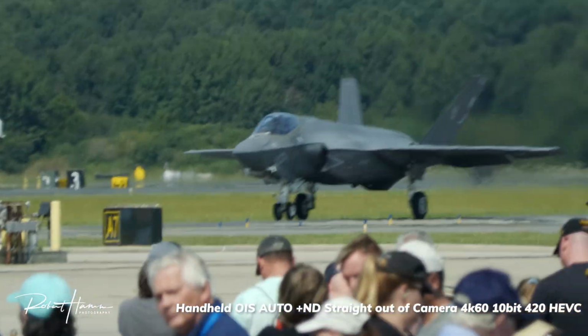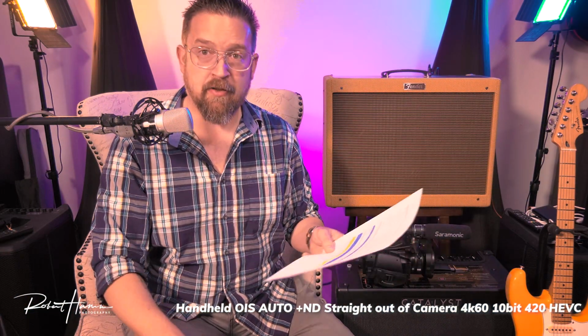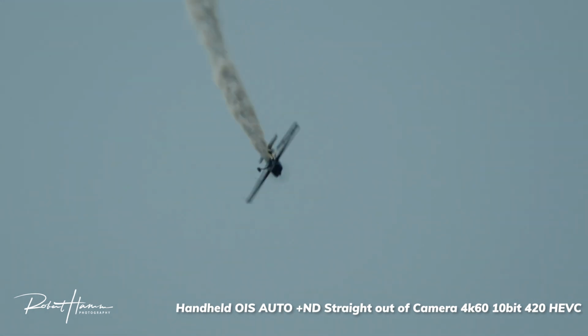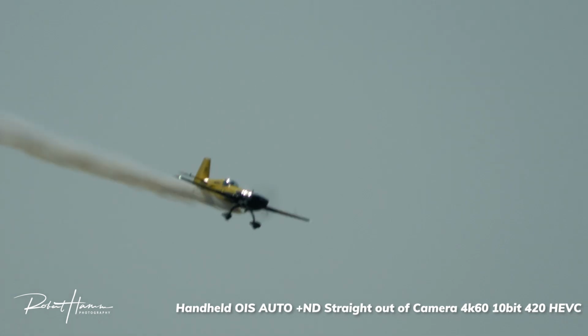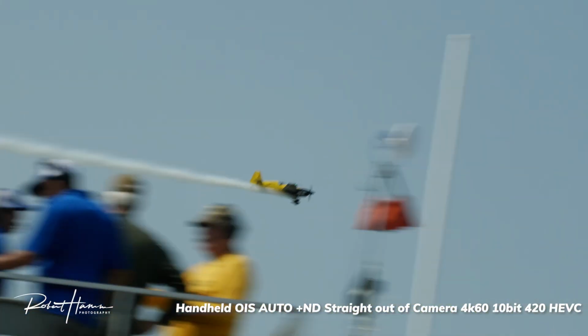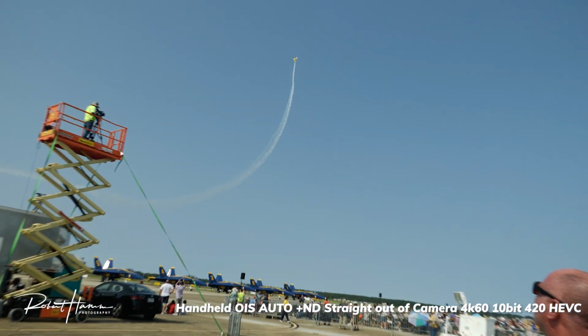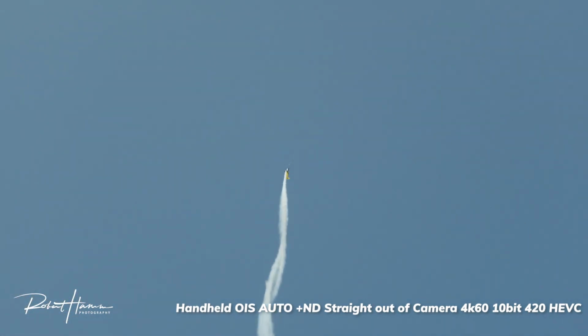Anyways, the sensitivity is 1145, and saturation, when the sensor can't deal with any more light coming into it, is 3050, which sounds like a large number, but I have another one for a global shutter in the 1-inch category. In that global shutter with a much higher readout, much more expensive, you can get into the 30,000s, right? So 10 times as much, and that's a thing.